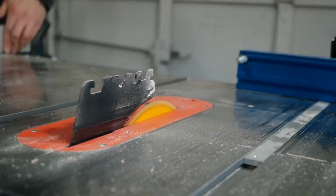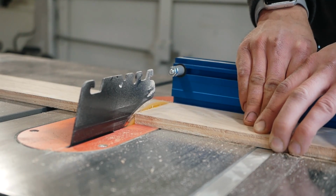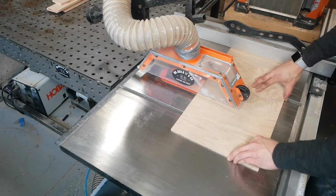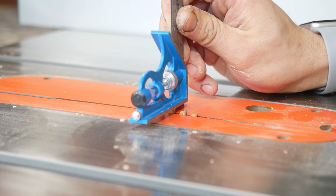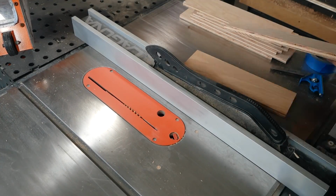I did it to keep it light and not too heavy. As far as the dimensions, the bottoms, the 1/4 inch oak ply, were 12 1/8 by 14 1/2, and then the sides were 3 3/4 inches tall, and the dimensions for the front and backs were 14 1/4, and the sides were 12 3/4. Again, these are 1/2 inch material for the sides. Don't worry about memorizing these numbers. They'll be on Jen's plans. They'll make it nice and easy for you.